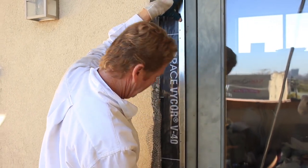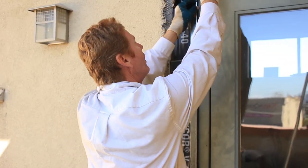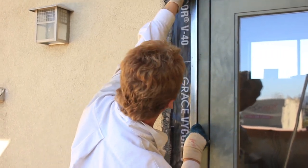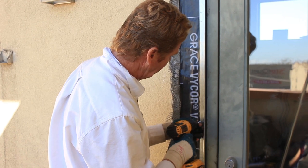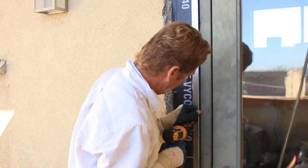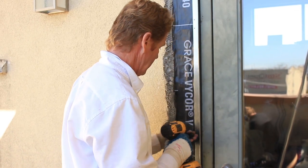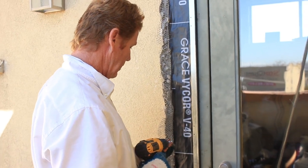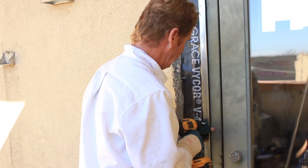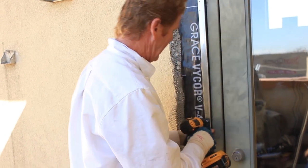We've looked at the rest of the doors and they're not perfect. Everything else is pretty much perfect but we are going to have an eighth of an inch here where it hits, a quarter inch here, and then an eighth of an inch on the other side. And of course because this is steel frame we're using screws to fasten everything. To get my J trim where I want it, I'm going to get one screw in here and we're going over two metals.